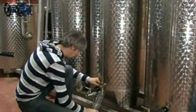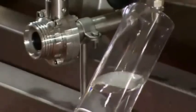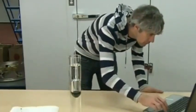Throughout the distillation process, they take samples to measure the density and temperature. These readings reflect the current alcohol level. They adjust the distillation speed as required to produce a target alcohol level of 76%. Only the middle of each batch, known as the heart of the distillation, is collected.